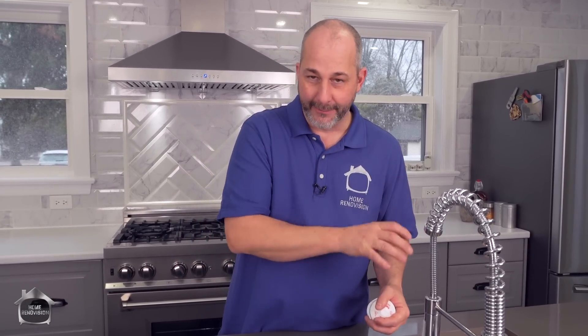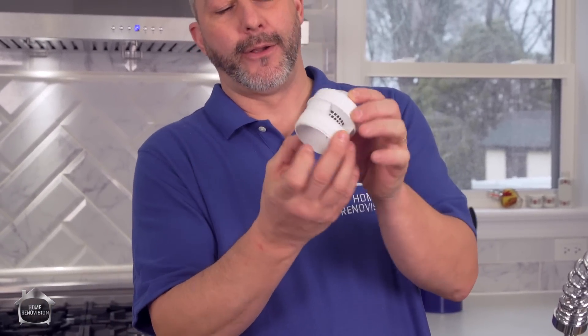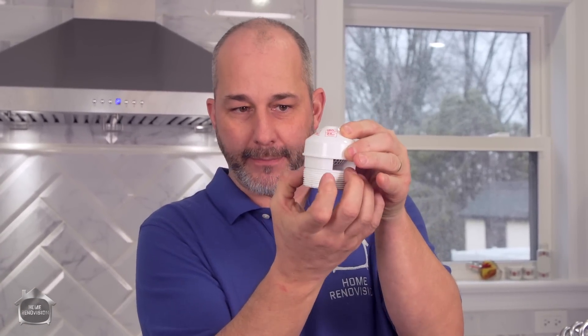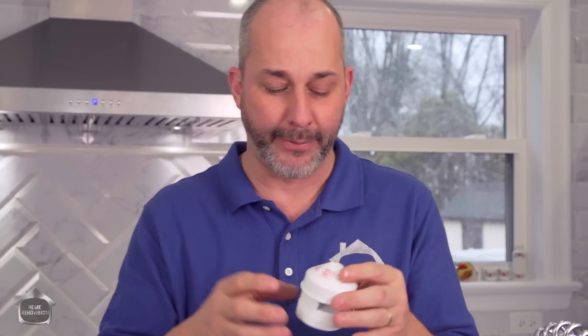The one way to solve this problem — if you don't have access to connect the vent to the vent system of the house, and in this house it's an 1880s build, so running piping underneath all those obstacles is just not an option — you can use one of these. This little gizmo here is an inline vent. The idea is that it's spring-loaded, so when a vacuum is created in the pipe it opens up and lets air travel in, and when the vacuum is gone it shuts again so that it keeps sewer gases from coming into the house.